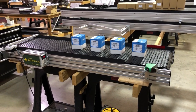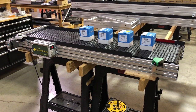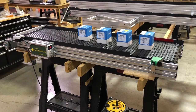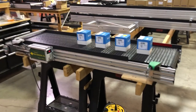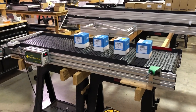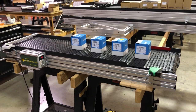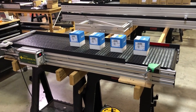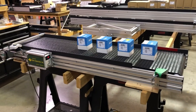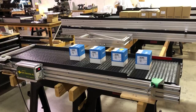Welcome to Safe Conveyor. This video demonstrates a safe conveyor with a photoelectric eye used to index parts being dropped on it. For example, if you have an automated process producing a part or filling something, it needs to be taken out and placed somewhere. When you come back, unless somebody has taken that part, it's still sitting there. This system uses a photoelectric sensor to solve that problem.